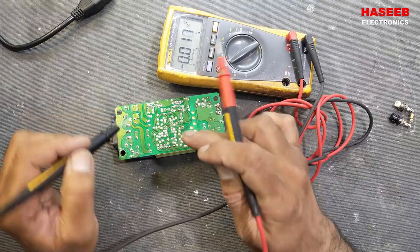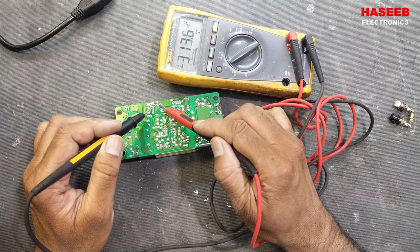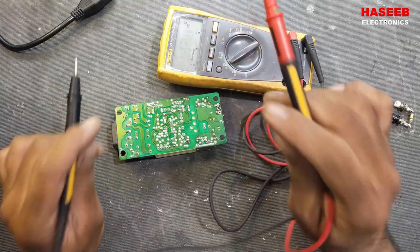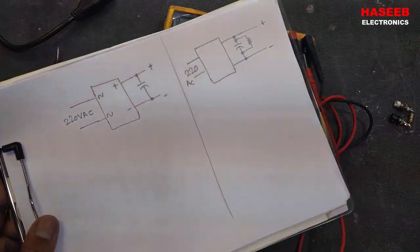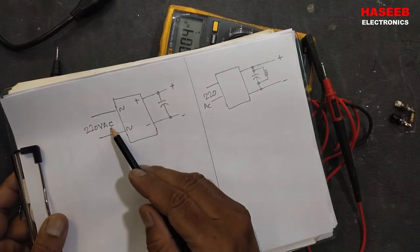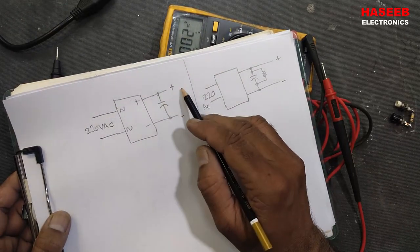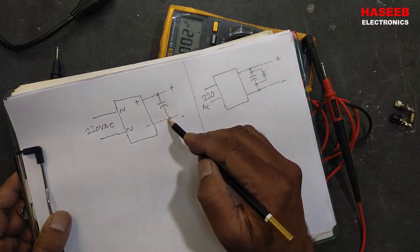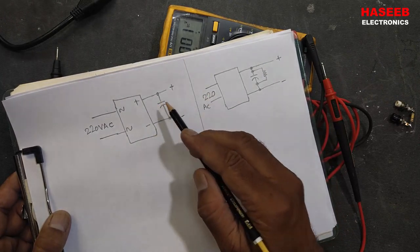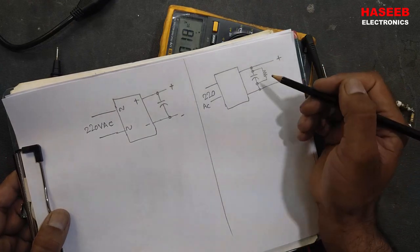If I want to test or remove any component or touch it, it is very dangerous. In some power supplies you can see the voltage is still stable. In some circuits, AC input is applied to the bridge rectifier and then to the capacitor. If the next circuit is off and not working, this capacitor will maintain its charge. If the circuit and capacitor are good quality, it may hold the charge for 24 hours or more.